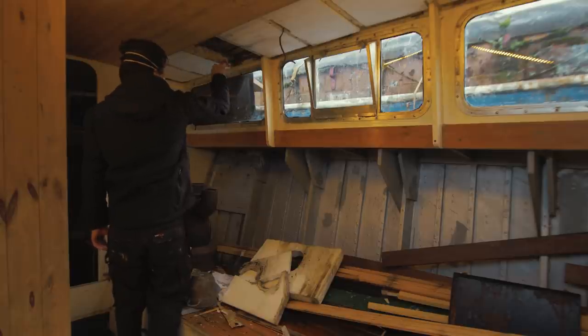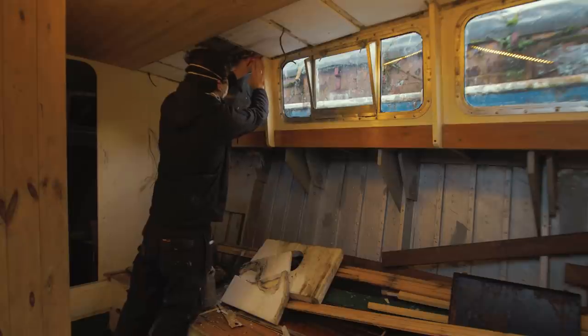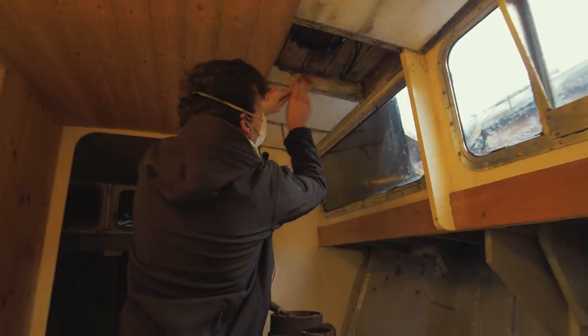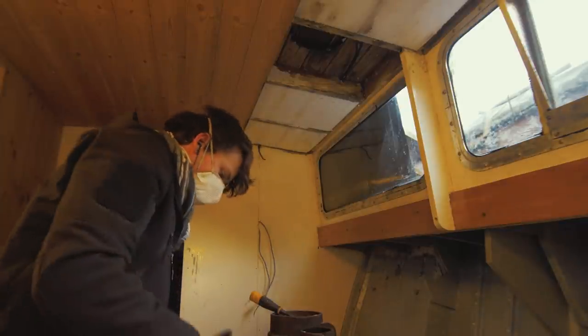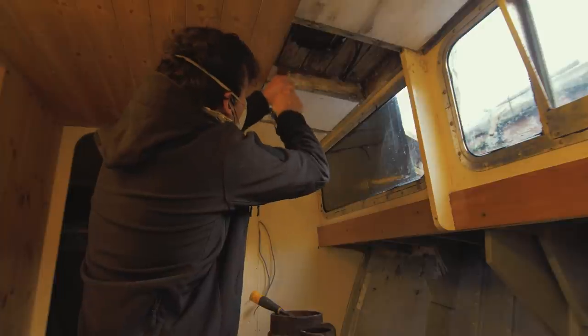And you step down into the next fore cabin, where the styrofoam is, it's insulated with the styrofoam, and then it's got those planks. You've got no drips going through any of that, so obviously it's doing its job. It's keeping it insulated and the roof planks insulated. So it just goes to show you, I think what we'll do is get some styrofoam stuck up in the wheelhouse cabin roof.